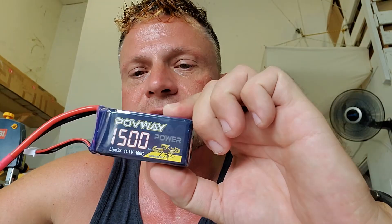A big thing to understand: you do not typically want to run any battery other than a sealed lead-acid battery in the wet without some form of waterproofing. I have successfully run lithium polymer batteries — such as this little guy here — in the wet using a waterproof housing.